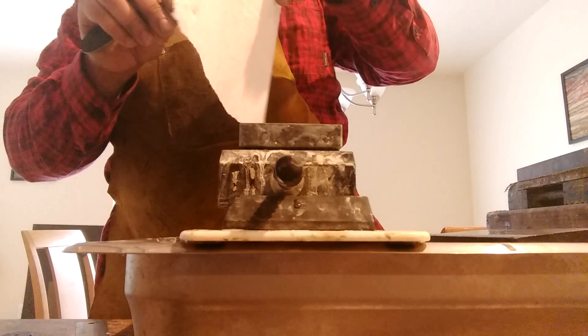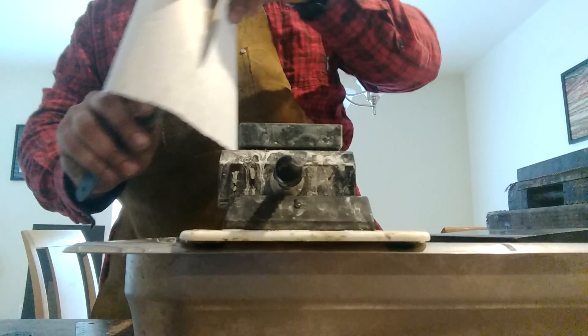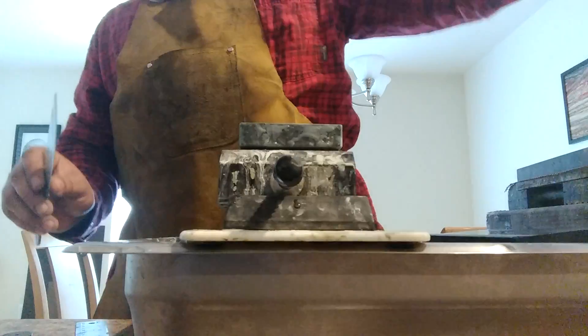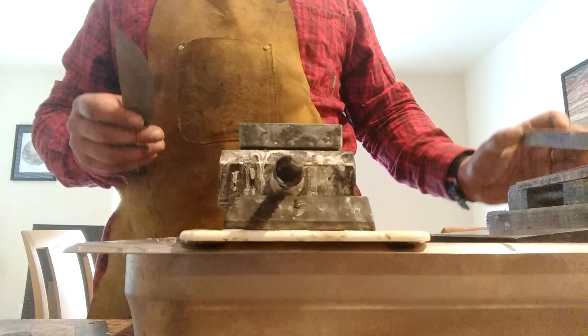Just curious if we'll cut this paper towel material. Yeah, too rough — you can see how we're cutting through there. But again, we're at 400 grit, so it'll cut it. But 400 grit's too rough. We'll bring it up to about 800 grit and that'll be a better edge. We're not trying to do a final sharpening — I'm just trying to look at it and see where my bevel is.